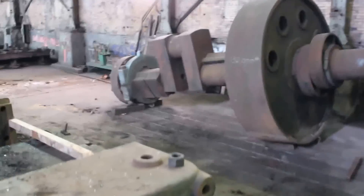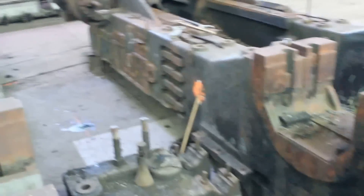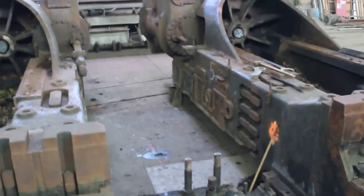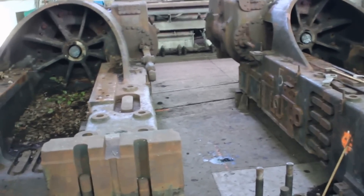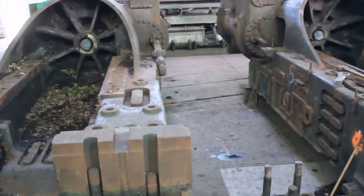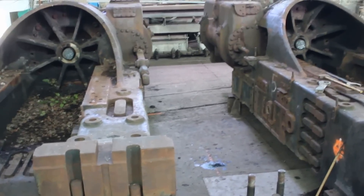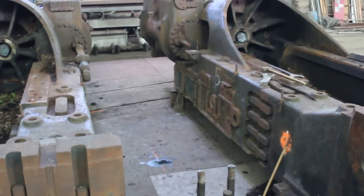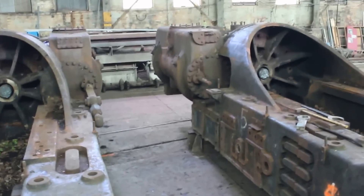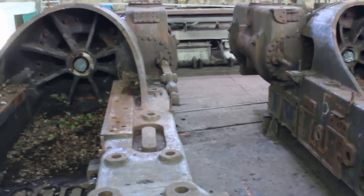This engine is really nice from an installation standpoint. With these three distance pieces that bolt together, there's really no way of installing it so it's not perfectly aligned. The Todd engine, by contrast, has its cylinder end about an inch and a half out of alignment and I have to jack it up, move it over, and have someone come in with a laser to check alignment. With this engine it's impossible to put together without it being aligned — that's a nice feature used on reversing engines because the forces involved are much different than on one that runs continuously at one speed.